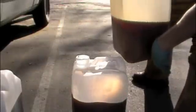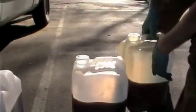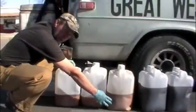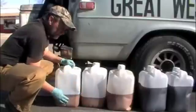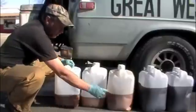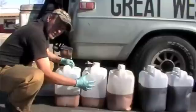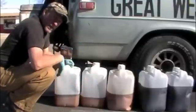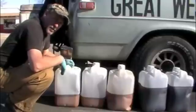As you can see, I got most of the amber oil off the top. I've now got three containers that are mostly the creamy hydrogenated oils at the bottom. I'm going to combine them into one and let them settle for about a week. These small lines of amber oil will rise to the top and combine, and there will be enough for me to pour off the top into my amber oil containers to turn into diesel.